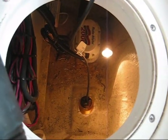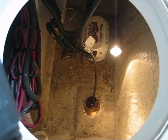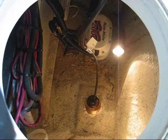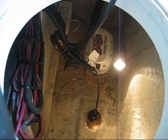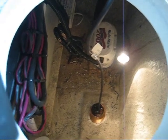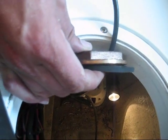It's kind of hard to film in the bilge here with the work actually happening, but what you see now is the transducer is mounted in the hull and we put a bead of 4200 around the inside. You can see the cable is all perfectly clean. That's because we did not put any of the 4200 in the boat or on the hull before we pushed the transducer through — we only put the 4200 on the transducer. So now we're ready to install the rubber gasket and retaining nut.